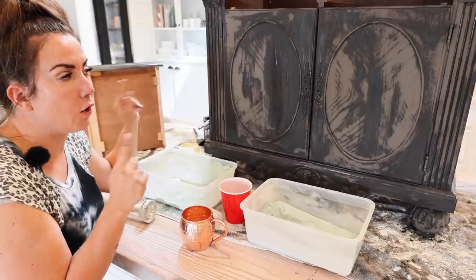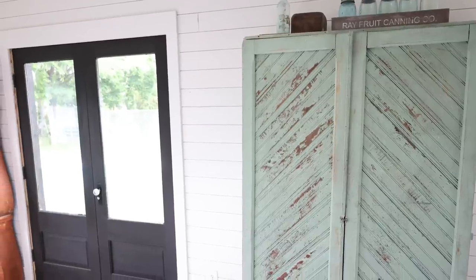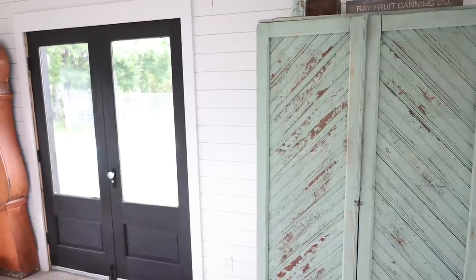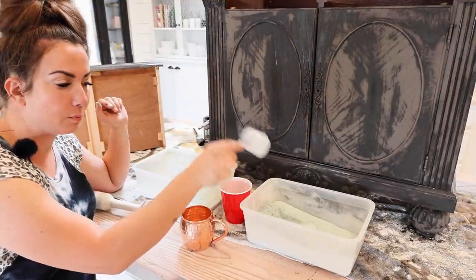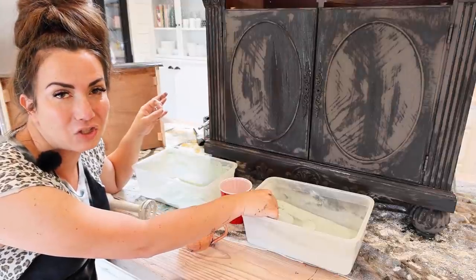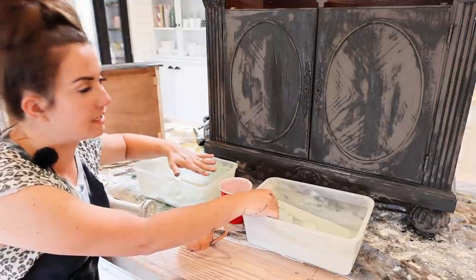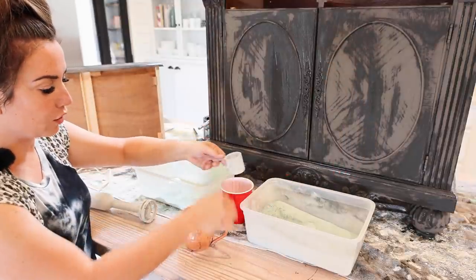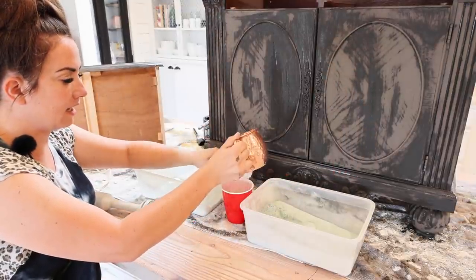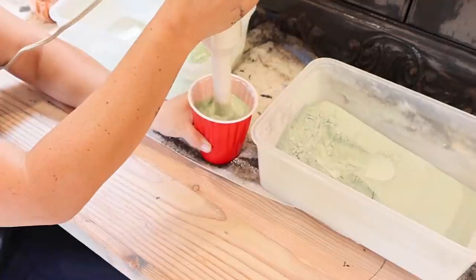We are going to be putting milk paint over the top of this DIY paint. The color on my buffet and big hutch is no exact color — it's a mix of 50% Sweetie Jane to Pantry Door. I use little scoops and buy my milk paint by the gallon because it's cheaper. If there are colors you use a lot, buy them by the gallon, store them in a Tupperware, and you'll save money. I've got one scoop of each color with warm water — warm water is really important for mixing — and I like just a little bit less than 50-50, so it's a little bit thicker. You can use a whisk or an immersion blender.